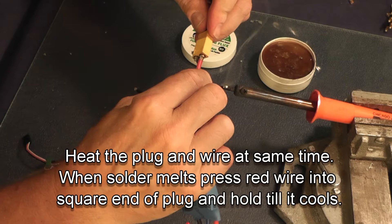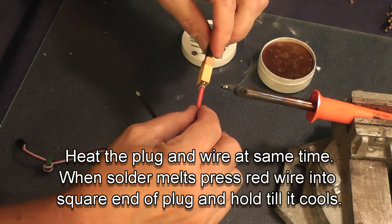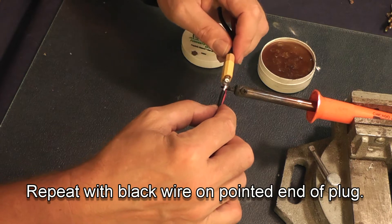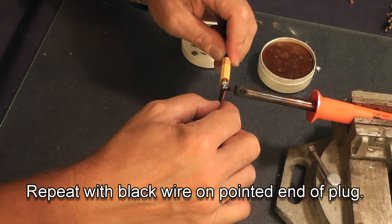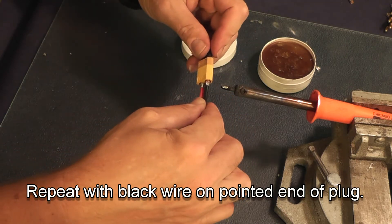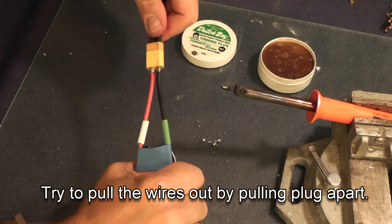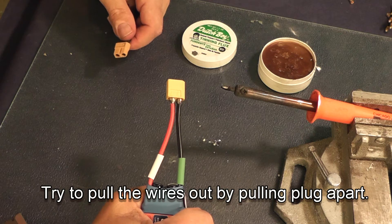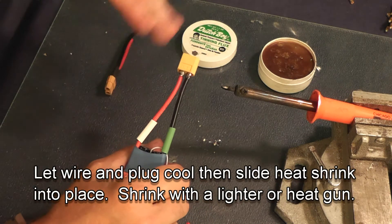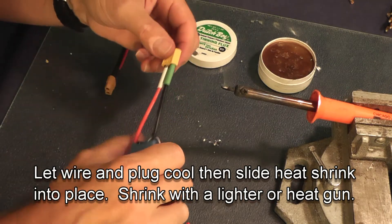It attaches very quickly. Heat up the wire, and after the solder is flowing and you see it start to shine, just work it into the plug. A good way to test the plug is to just pull it apart and see if both pieces stay connected. Make sure also that neither of the plugs has moved because the plug itself got melted while you were soldering.